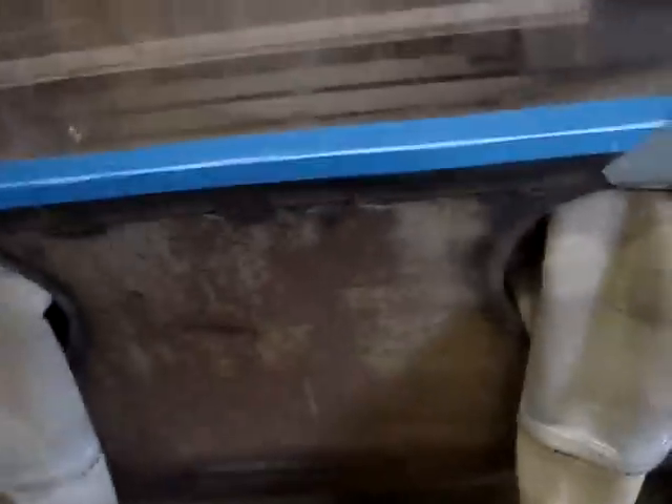The window here is just a piece of plexiglass. Got it sealed in there with some tape to help seal it up better. The top is held down by a piece of angle iron that's just bolted down to hold the top. On the sides where it slides, a piece of 1/8-inch metal and then a thin strip of metal on top of it are welded together so that the plastic just slides down inside a groove. Where the cord for the light goes in we just have a hole and then it's all siliconed shut so that stuff can't leak out of there.